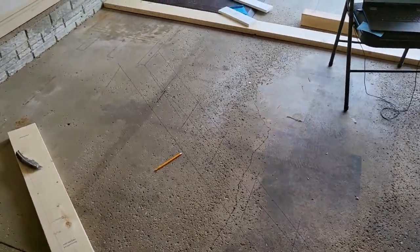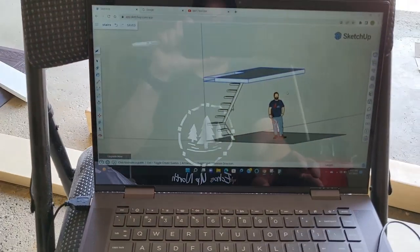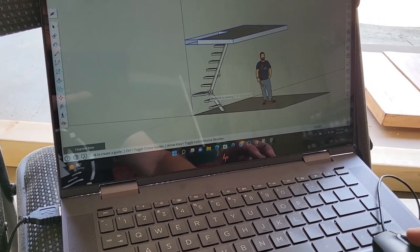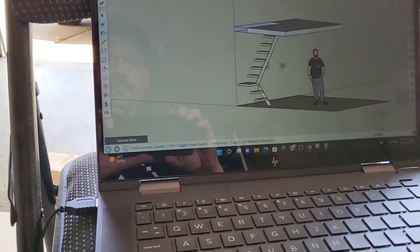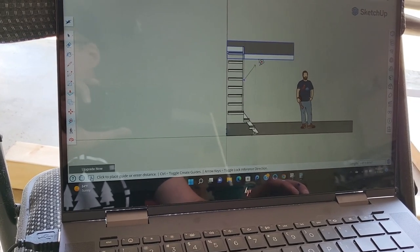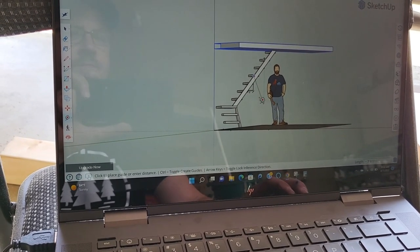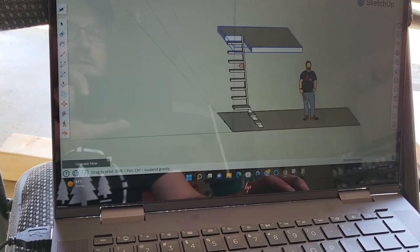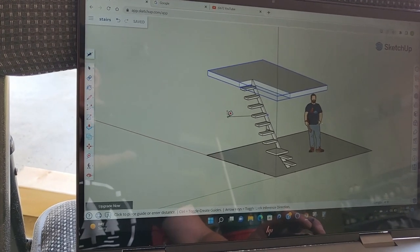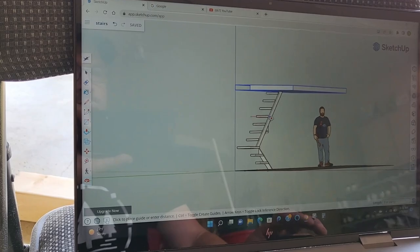What I decided to do was take my CAD model and actually draw it in full scale on my garage floor just to simulate the cabin layout. As you can see it's nine stairs with a landing, so ten total stairs — it goes up and then takes a turn. I laid out both the floor and the loft on the garage floor so I could get the stringer laid out right and also get the platform and landing location correct. I like to do that, especially when you're building off-site. The CAD should be correct, but I want to see it in full scale — it works better for me. And the big catch was that as I was laying it out, I made a mistake, which I'm glad I caught. It's always good to draw it out before you start cutting boards.